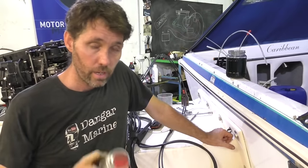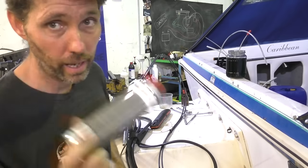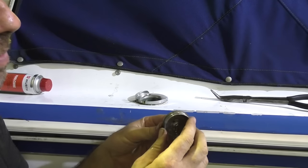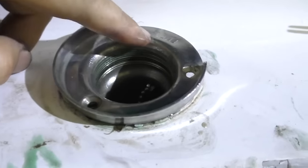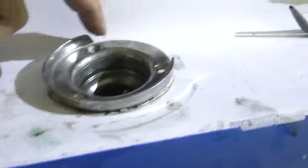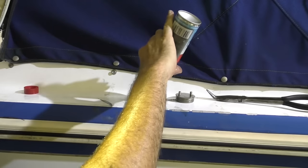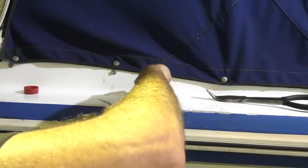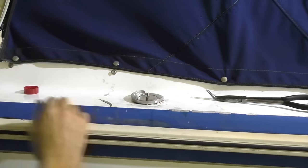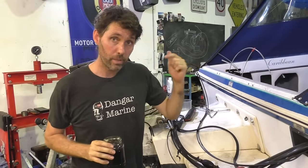This next jar is looking really clean too. I'm going to add the fuel cure to the tank just to be safe. Actually, while I do that, let's have a look at the fuel cap in case there's a problem there. I'm not sure if this is supposed to have any sort of o-ring — doesn't look like it should. I doubt any fuel really gets through the thread, but there are no screws in here. Putting some Sikaflex under here and some new screws in here would be a good start so that water can't get under. This fuel cure treats up to 100 litres — you can't really overdose it, so we'll pop that in. The final jar is looking really good too, so I'm putting a hose clamp on the fuel line where it attaches to the outboard. I think we can consider the fuel and the oil good to go.